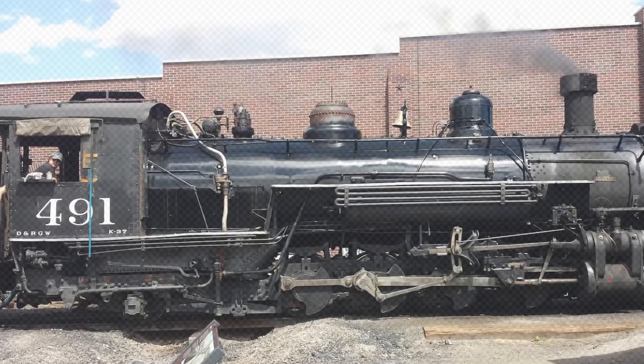Level eight: the air compressor. Why do we need air in a steam locomotive? We need air for a lot of different reasons. The air comes over in a pipe and runs through radiator piping, which allows the air to cool — if it's been in a steam-powered piston it's quite hot with a lot of moisture. Then we store it in what we call the main reservoir, typically at 130–150 psi. We have drains on the main reservoir so you can get rid of the water at least once a day — hence the 'drain daily' tags you'll see on these. Then we take the air from there and run it to various things on the locomotive.